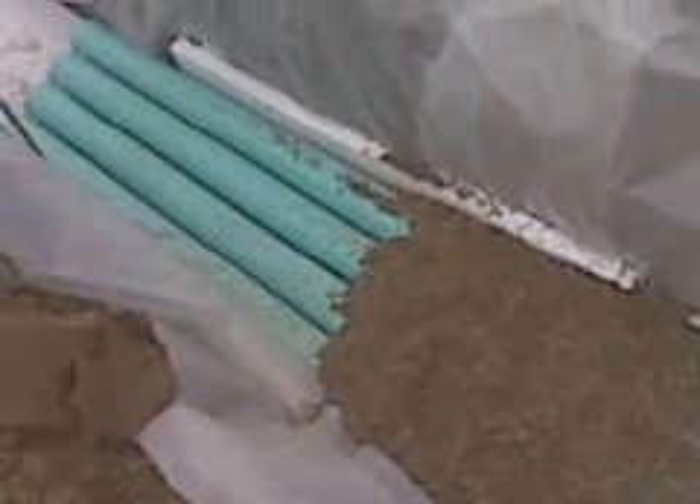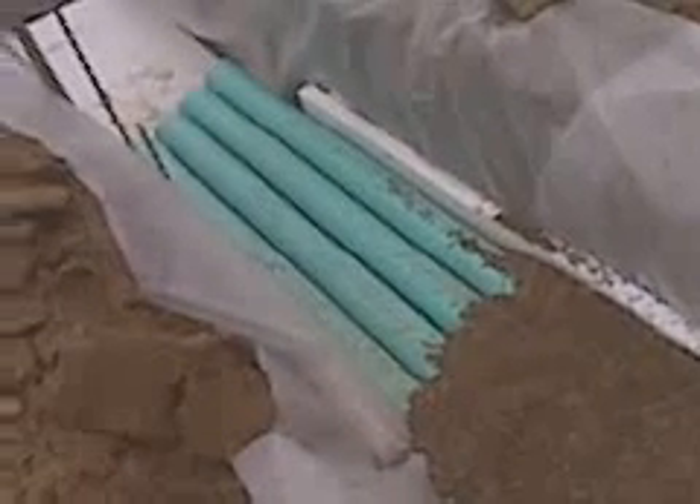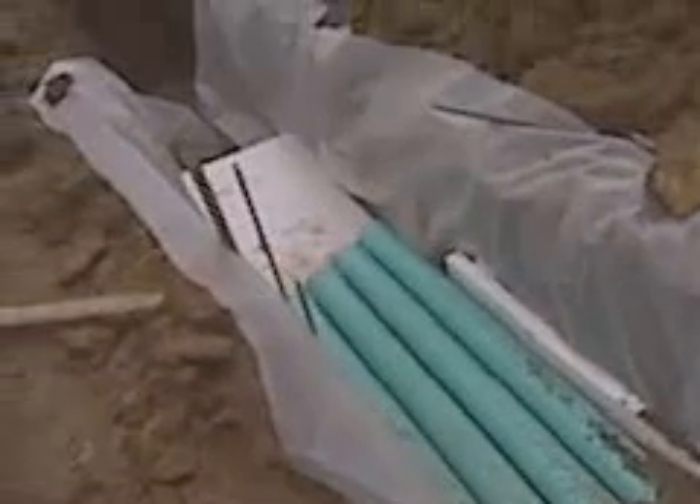The pipes are laid into the ditch, wrapped and insulated with expanded polystyrene, and then encased by six-mil plastic and backfilled. And out there is a point of exit.